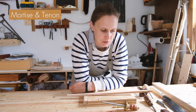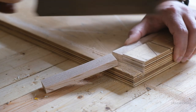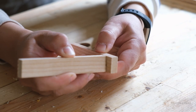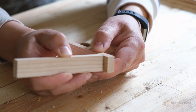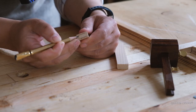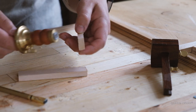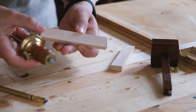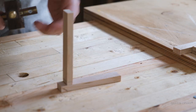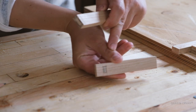First up, let's do a mortise and tenon. It's such a classic traditional joint that you use when you want strength — tables, workbenches, substantial pieces of furniture where you need a lot of strength. One piece is going to go into the other. Let's inset it a little bit. Working with such small wood is so finicky and tiny. I've got a mortise gauge — I think that's going to work. So now we'll make our marks. How far do we want to go into this piece? Maybe about half the thickness or a little bit more. We've marked where the hole is, where this is going to go in.